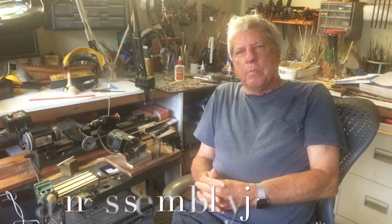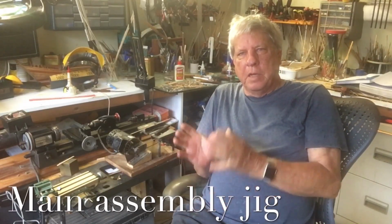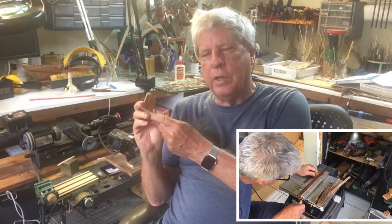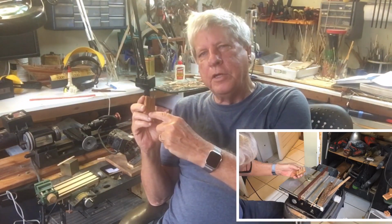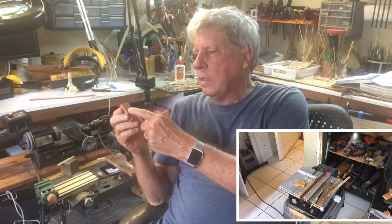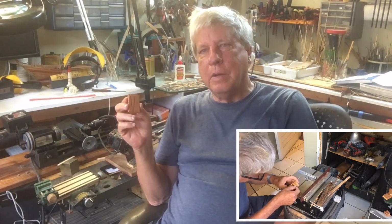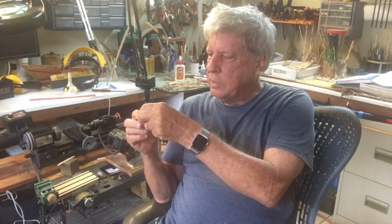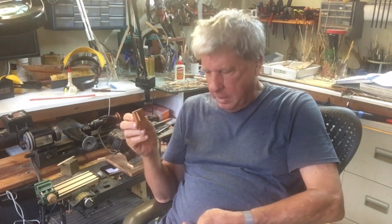It has taken me upwards of a day to actually make a complete gun carriage stand. The first thing we've done is cut a block of wood which is perfectly square, and on the table saw cut out the 2-degree alignment lines that are going to hold the brackets in place, and you'll see that that slips neatly in.